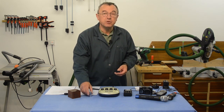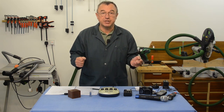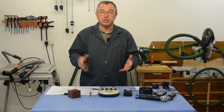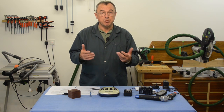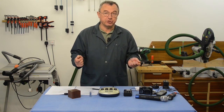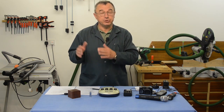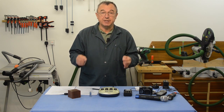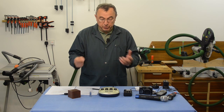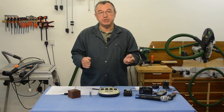Chargers come in really three main categories. At the bottom end is the basic charger — the sort of thing you find at the end of the aisle in the supermarket or in the bargain corner at the DIY store. These just provide a large current and voltage to the battery, the battery gets hot, there's no monitoring of the individual battery, and it's not good for the battery at all. In the middle category you have fast chargers, which provide high current initially then taper to a trickle. But again there's no individual cell monitoring, and in both basic and fast charger categories you may have to have two batteries together to do any charging at all.